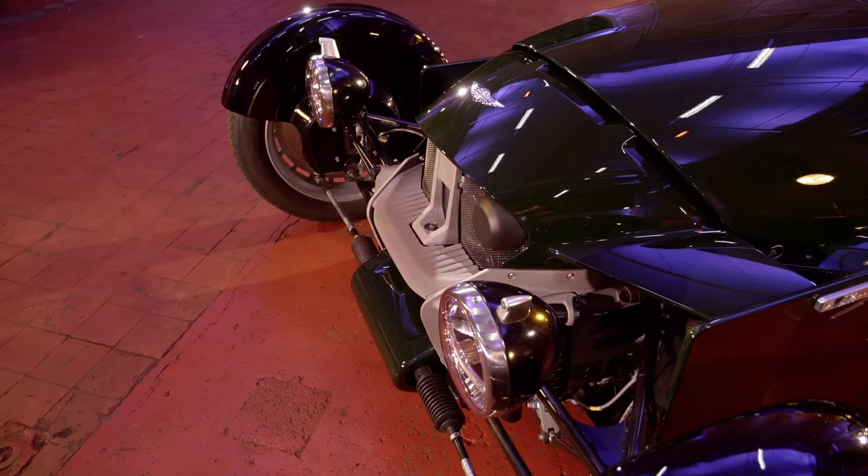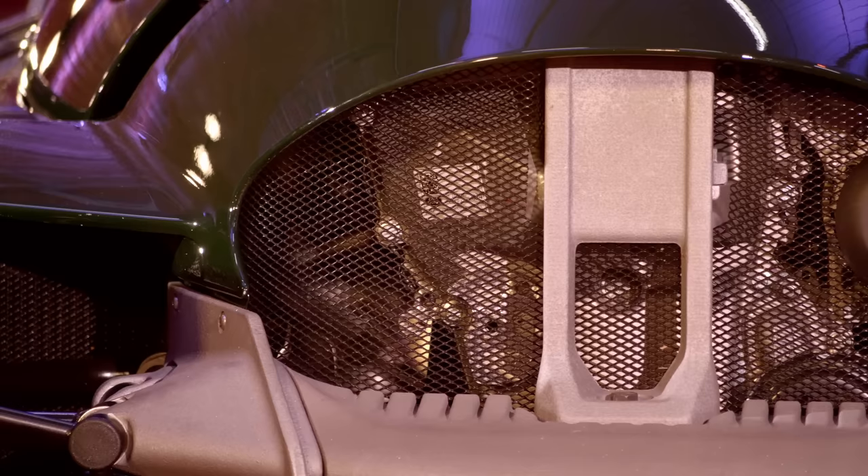To be honest, we started with the engine. You hit the nail on the head. The first thing we did was set out to explore the powertrain — the right one — and that completely informed the character of the vehicle. We first started looking at motorcycle powertrains; that seemed like the obvious place to start. Modern motorcycle engines typically have integrated gearboxes, which brings challenges: how do you splice in a reverse gear? How do you overcome the sequential gearbox on a test drive? We soon realized there are so many compact inline small three-cylinder car engines out there that maybe we should look at the car-derived route as well.